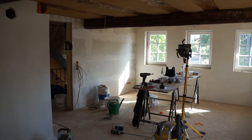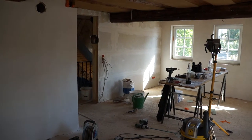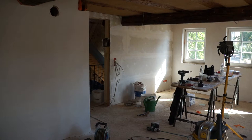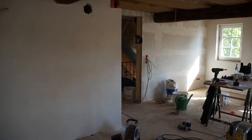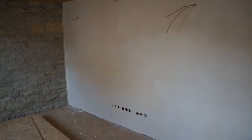Just a bit more detailed work to do, then we'll put on a — I can't remember the English word — Grundierung with sand on the walls to give a sandy texture, and paint directly on top of that. We think that having something absolutely smooth means you'll see every mark or dent. In this area we're going to have wall lighting, so if I haven't been absolutely perfect you'll see every single dent or wave in the wall with the light shining down on it.